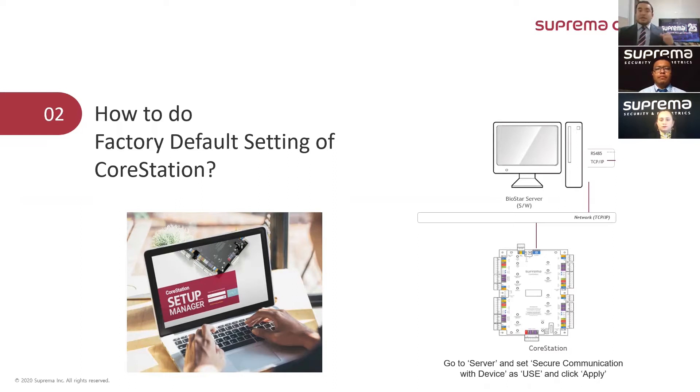After we perform these changes, we should go to the physical INIT button on the device and press it three times straight, then wait for some milliseconds, and then press it once again. After this happens, the device will take some time to come back up, and when it does, it will be in factory default.